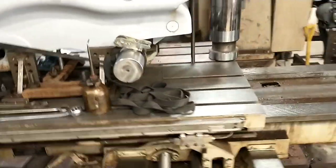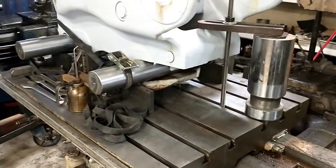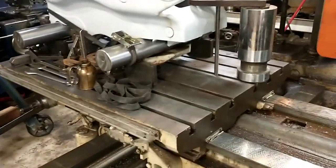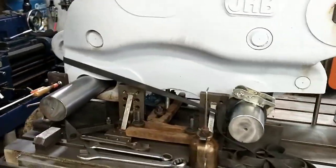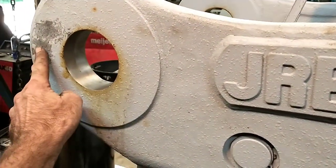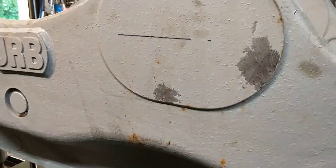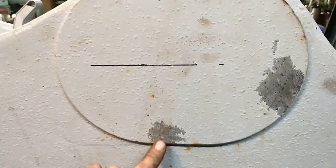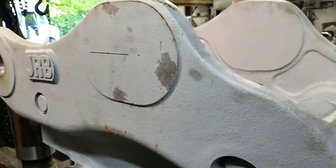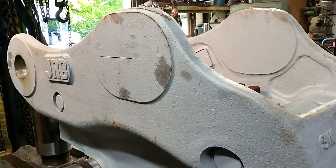So I went ahead, grabbed a pair of brand new 100mm pins, set it up on a set of my parallel blocks, and got the thing all trued around as far as square to my table. You can see where I came over here. These are machined faces, but they painted them so they wouldn't rust up. So I had to scrape through and got on here with an indicator, indicated in, and then I decided, you know what, this is a machined face, I ought to make sure the part's square. I indicated from there to there and got almost 15 thousandths out of plumb.